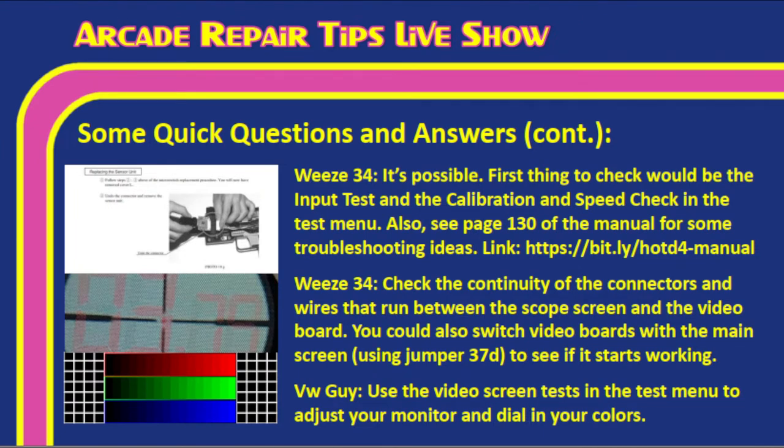So, on the Silent Scope 2 issue, Weez34, check the continuity of the connectors and wires that run between the scope screen and the video board. You can also switch the video boards with the main screen, okay? And this is what Tim was talking about.